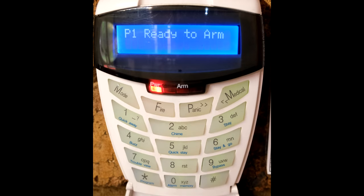In this video I've shown you how to measure the voltage, how to measure the current, and how to observe the behavior when zones are connected. You can now check if your individual zones on your panel are functioning. Thanks for watching.